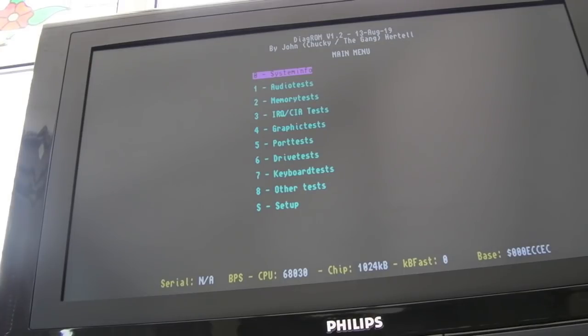So I think what's happened is, as I've reflowed lots of things, swapped out those 161s, removed the 174, and just given the board a really good scrub, I've fixed the problem, but it still wasn't booting. Obviously, just reintroducing those two GALs has solved it. We get sometimes a green or a red screen here, so there's something not quite right with it. Can you see it's not going any further than that?